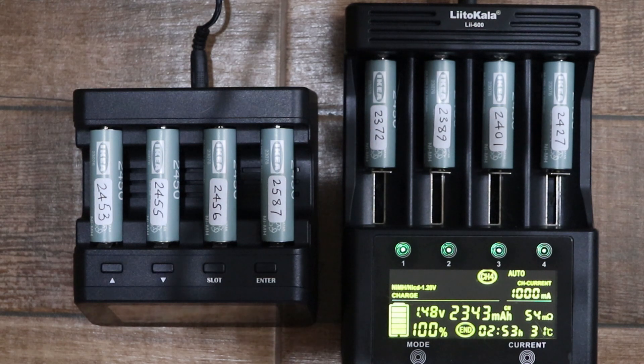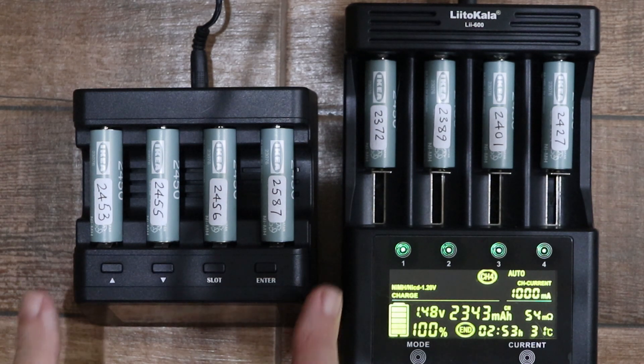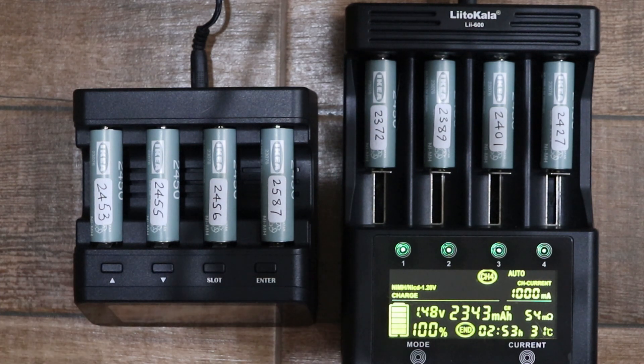When I did that, the results were still high using the PowerX. With the PowerX, when I fully charged them first and then discharged them, I got readings of 2658, 2528, 2616, and 2599 — all a lot higher than the 2450 I expected.